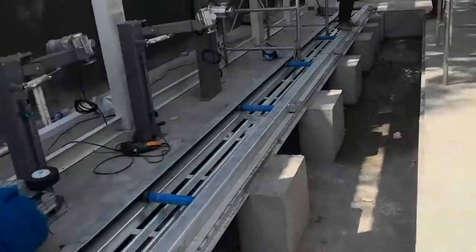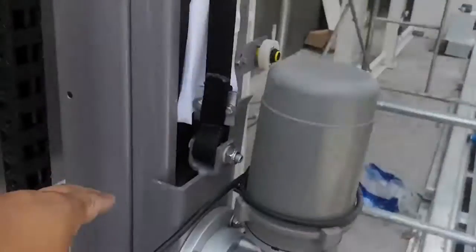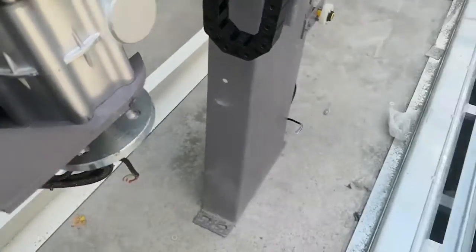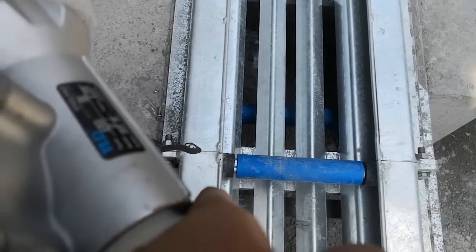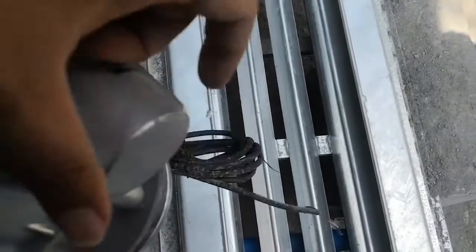And fix the small vertical brush. First, you measure from the horizontal brush leg, from leg to the middle. Okay, it's 40 cm. Then it's okay. Then when the brush closes to wash the car, just make sure this thing goes to the middle. You see this same level here. Okay. Here, same. From here to the middle is 40 cm, and from this area, same level here. The middle, okay.